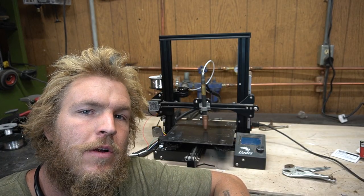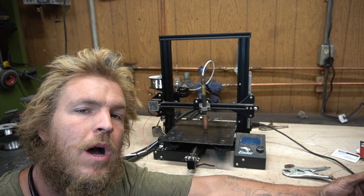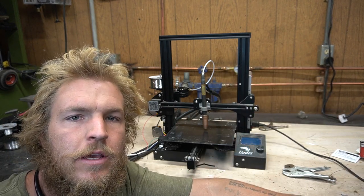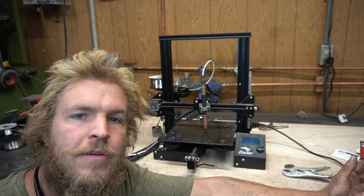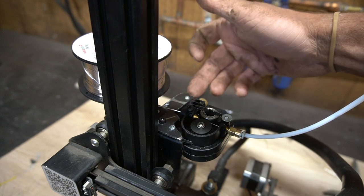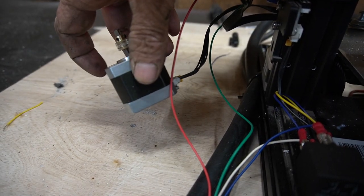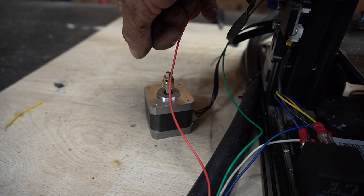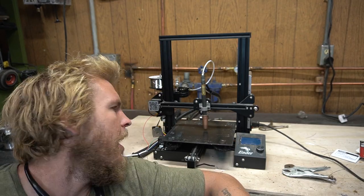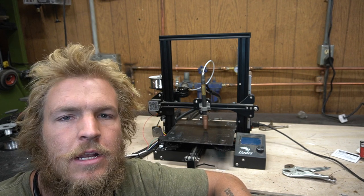This is obviously not working very well. The problem is I'm trying to use the stepper motor extruder on the 3D printer to feed the wire. The way any slicer I've found works, the feed rate for the extruder and the gantry are matched, which doesn't work for welding — we need a lot more feed rate for the extruder. That could be fixed by writing a new slicer, but we're going quick and dirty. So I've taken the wire feed mechanism from the spool gun and stuck it on here — now all wire feeding is controlled by the welder. The stepper motor stays; we'll make it spin a little flag. I'm also switching everything over to welding steel, since I've got far more steel I'm willing to waste than aluminum.